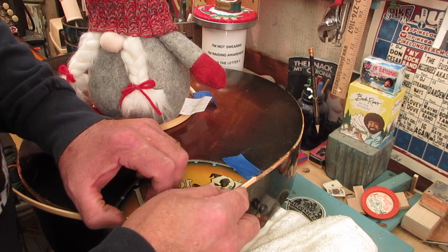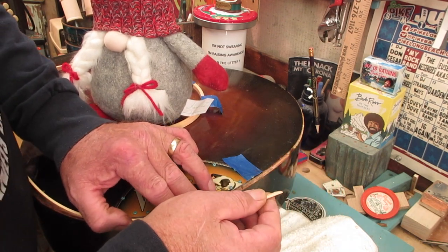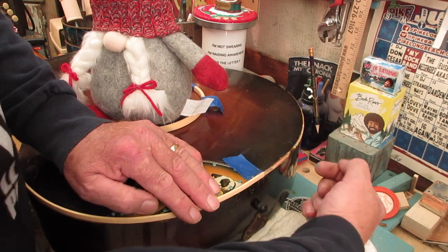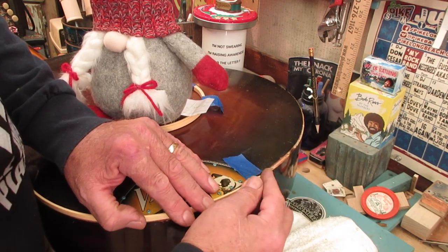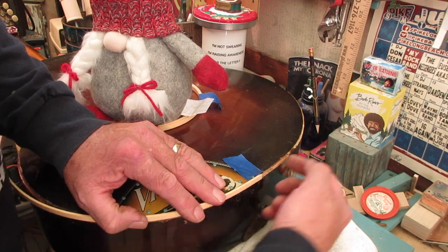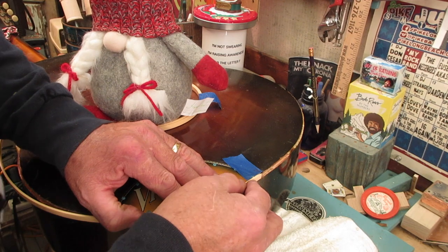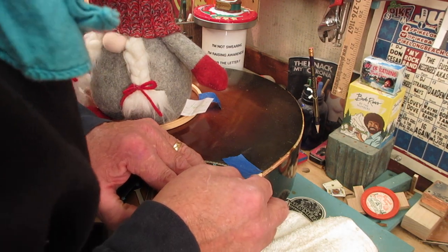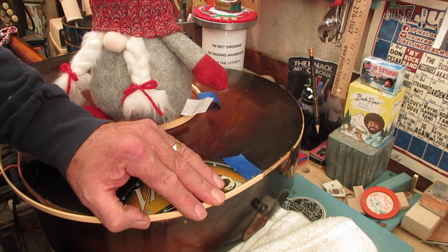Last thing I want to show you is I've beveled the end of that. I don't want this to blunt when the other end comes in. I want to make a bevel like this, and the other end when it comes in will be beveled the other way, and I can work it and slip it with this being solid, that this will fit underneath here, and then sand it to where it looks almost unidentifiable. But this is where I'm going to start my repair right there.